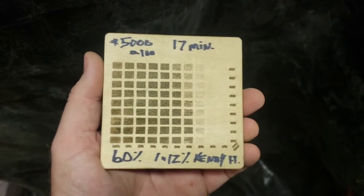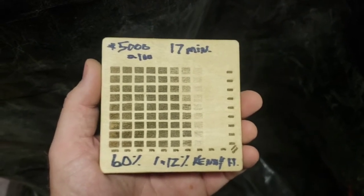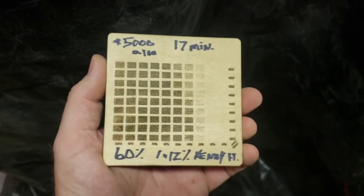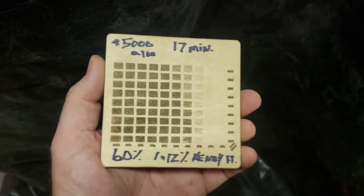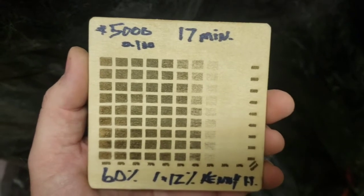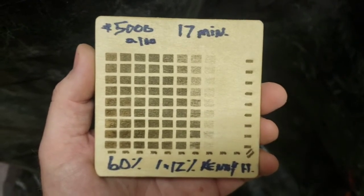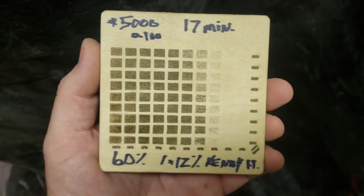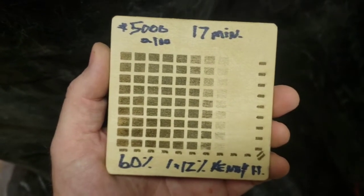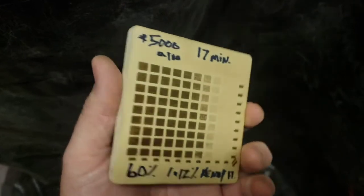Some woods you might find it'll turn gray. You just have to do some tests to see what it does and how dark you want to put it on. You can dilute this down pretty low — this is only 12% and it's still working very well, even at high speeds, even 6,000. It had a pretty good gray strip. I decided to run my test image at 5,000, a couple bands down, where I had a nice even gray in the lower ranges. This is run at 0.1 line resolution.